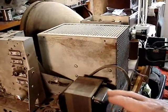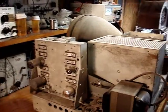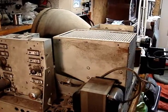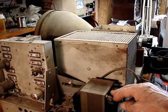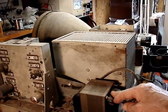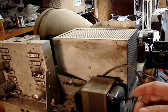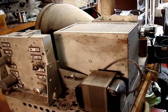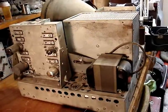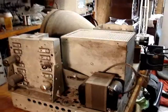I did slide this off and looked underneath, and they did put diodes in — they have a couple of diodes in. The other thing I noticed is this transformer apparently does not have a 6.3-volt filament supply. I saw this little tiny transformer underneath for all these filaments. So that transformer, if it worked at all, must have been cooking pretty hot to supply 6.3 volts to the whole set.